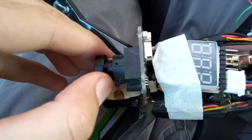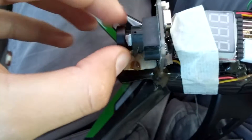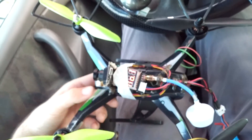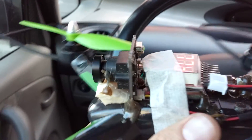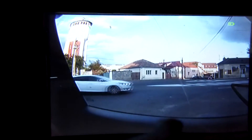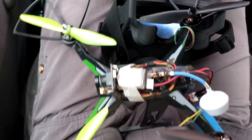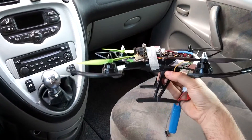With just that much paper on the lens it's much better — I can still move it but the vibrations should not move it easily. Now I have to turn on the goggles, do the focalizing, and screw it in. The lens is mounted, it's tight enough, and the image is good enough. That's the wide-angle FPV lens instead of the standard FPV lens on the JJRC X1 with an FPV mod done to it. Thanks for watching and bye bye.